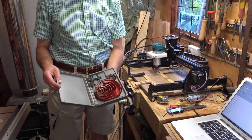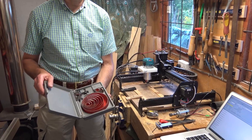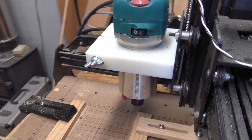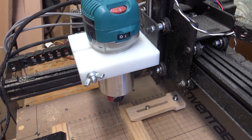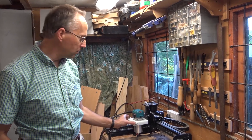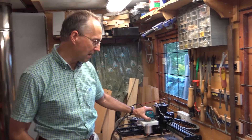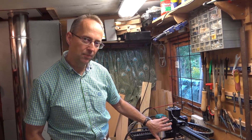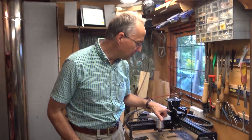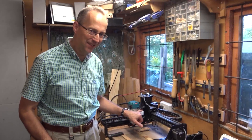We used a basic hole cutter set to get a nice hole of the right size. One could do it on a bandsaw, or by hand with a coping saw, but it seemed easier just to use the hole saws. We then put a bolt through to act as a clamping mechanism to actually hold the laminate trimmer onto the backplate. The HDPE is secured to the backplate by a row of ordinary wood screws, so nothing complicated there.